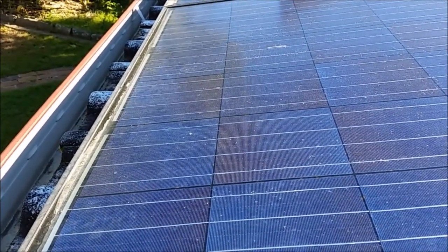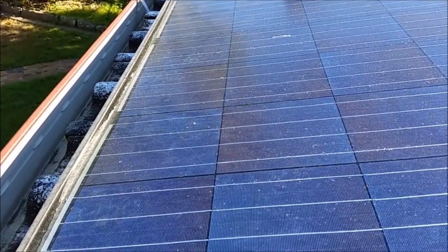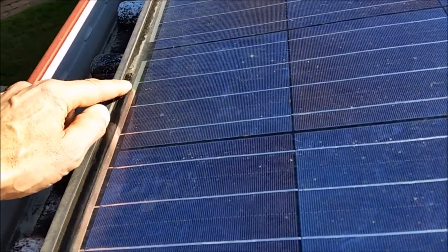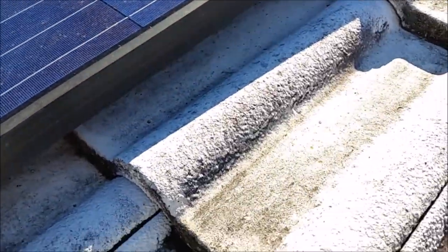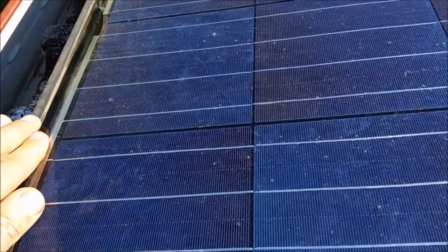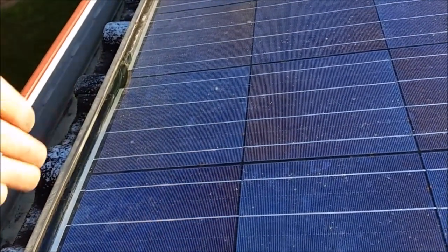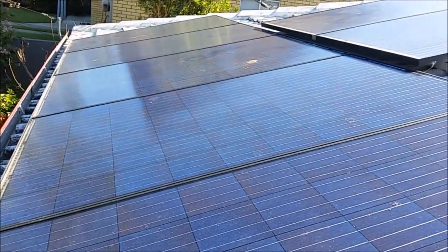When you do clean the panels, I personally use just a garden hose and a big broom with a large brush. When you wash them, make sure you clean the bottom edge as well — sometimes fungi starts growing there, the same fungi that grows on the tiles. This can actually cause some harm, so make sure you wash where the water sits in the groove with one stroke along the bottom edge of the solar panels.